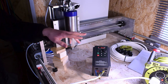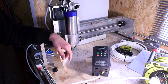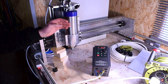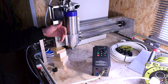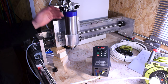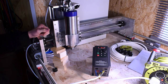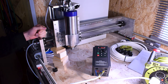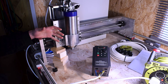Generally the manual says when you first turn on the spindle you should let it warm up — let it run for 10 to 15 minutes at a reasonable speed before using it, to help longevity. These are serviceable and generally last a couple of years according to the manufacturer depending on use. So that was a successful test — the VFD is working, the spindle is working, we can control the speed with the dial, and we can proceed with the wiring.